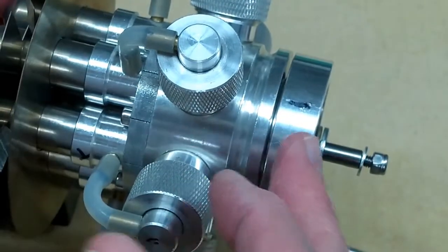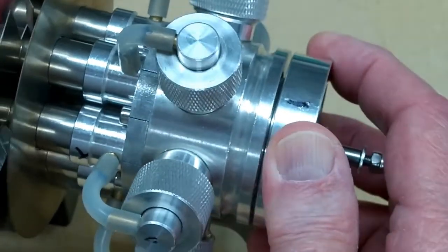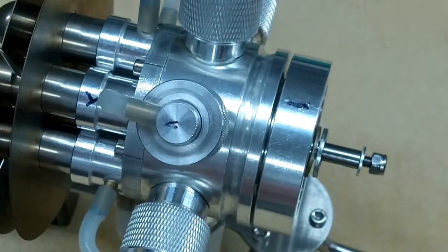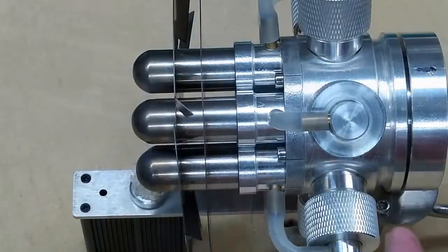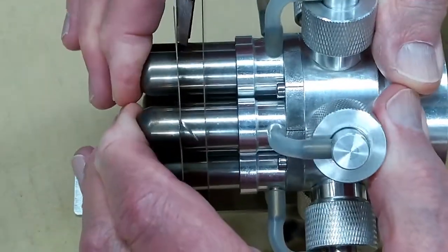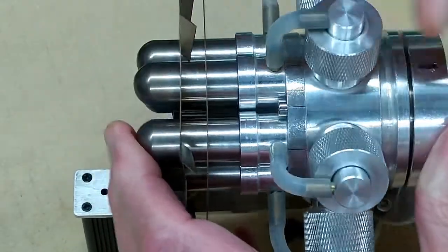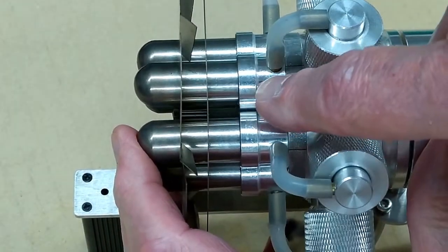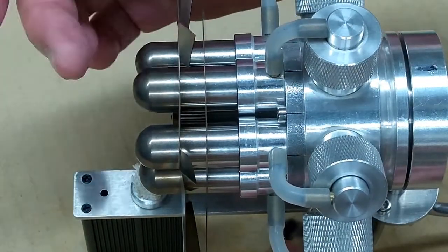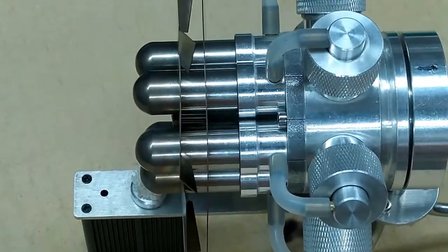When you have this apart and put the engine block back on here, you don't want the engine block too close to the support ring — you want a little end play in there, just a little bit. We don't want to create any resistance to this turning. At the end of each run, when this is cooled off, check that these displacer cylinders are seated all the way into the engine block or into these little adapters. The displacer piston going back and forth can hammer these outwards, and sometimes they'll move out about that far.